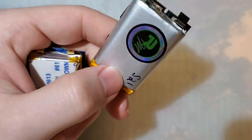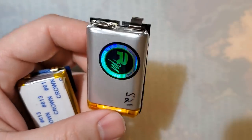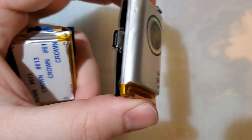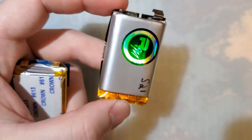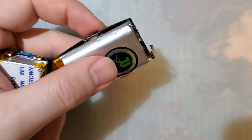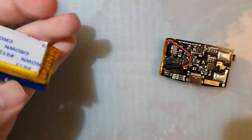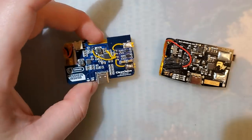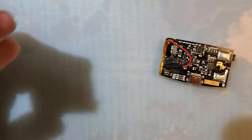Trickle charging, these lithium ion batteries have always responded better to charging as slowly as possible. Within reason, of course. I mean, you feed it 1 milliamp, it's probably going to self-discharge faster than it actually charges. But you get what I'm saying. The lower charge rate is ultimately better for the long-term life of the cell. I don't think 1 amp is high enough that it actually makes a difference, but who knows, long-term, maybe this cell just has lower capacity than this cell.